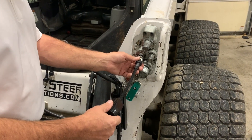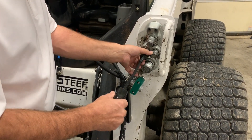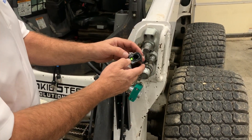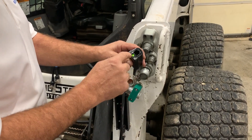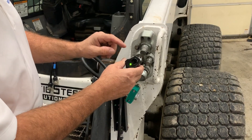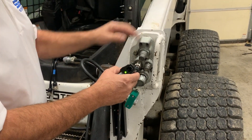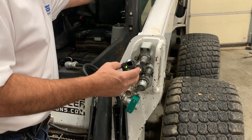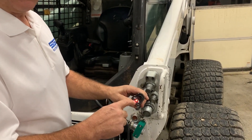Right now I have the key on — I don't have to have the machine running. I just line up these two lines here and connect it. You're going to see it go through a little startup sequence where it starts flashing. What that's telling me is I've got power connected, and when it's flickering like that it tells me I've got a digital signal — meaning it's talking to the CAN bus of the Bobcat and looking for a command. If I reach up and touch B1, it latches on so I get a solid red.